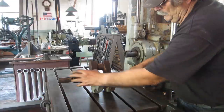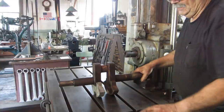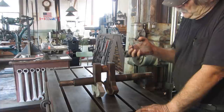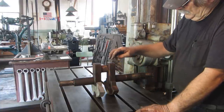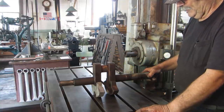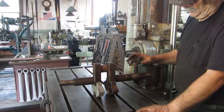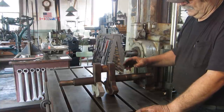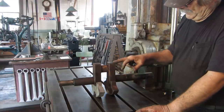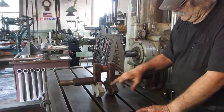The end of the shaft where the gear was on there. It must have really been cranking and something locked up in the gearing somehow, and it just twisted the end of that crank. So if and how much the rest of the crank is bent or sprung or damaged, that's the next step, and try to figure out whether we can straighten it, repair it, or make another crankshaft. If we make another crank, I think we can make it to use the original counterweights.